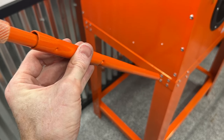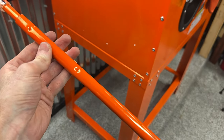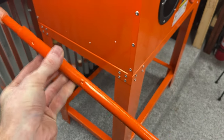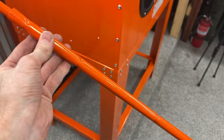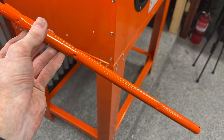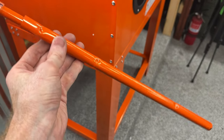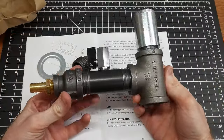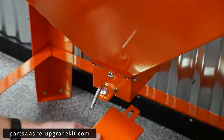It's very common in most sandblasters of this caliber to have a siphoning tube, and it's also very common for that to be the first modification people do — removing this tube and putting in a metering valve. This allows you to use way less sand in your funnel and efficiently feeds the gun so you don't get any spurts and stops when sandblasting. That's why we're going to be doing the metering valve from day one and not even bothering with the siphoning tube.